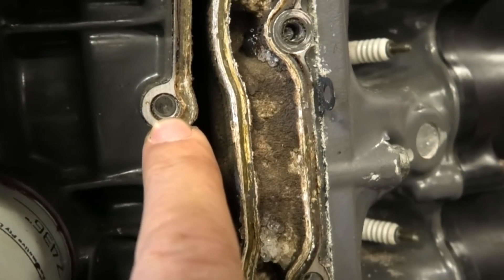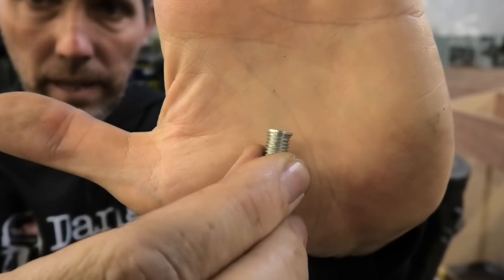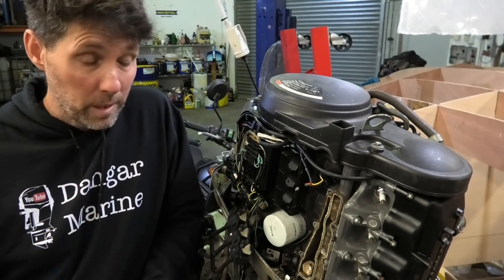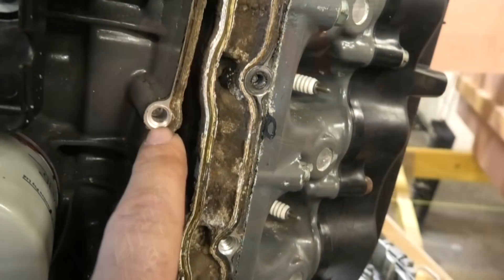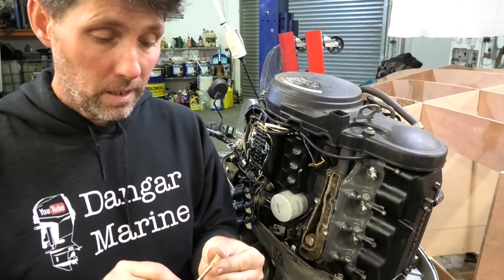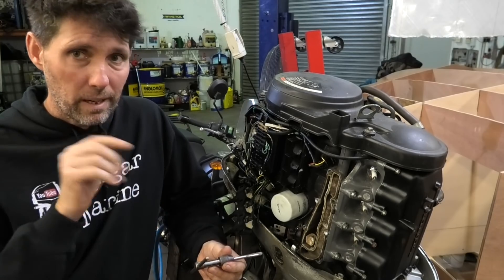What we have now is the hole drilled out to the diameter of the bit that came with the kit — there's no thread inside that hole anymore. Next I need to take the countersinking bit and just countersink a millimeter or so, just enough for the flange on the top of the insert to sit flush with the block. Once again you could do this with a T-piece, but I'm going to use a drill. It's really important that you tap reasonably square — the tap will tend to follow the hole anyway, so if you've drilled it straight the tap is likely to follow it straight as well.